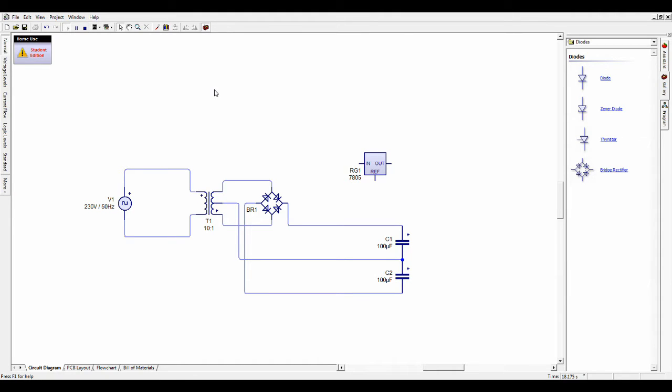But I'm going to put 7815, if they've got one. Have they got one on it? Yeah, 15 for 15 volt regulator. So that's so that you can get the full negative voltage rectified for use with op amps, amplifiers in general, audio equipment, things that go into negative voltages.